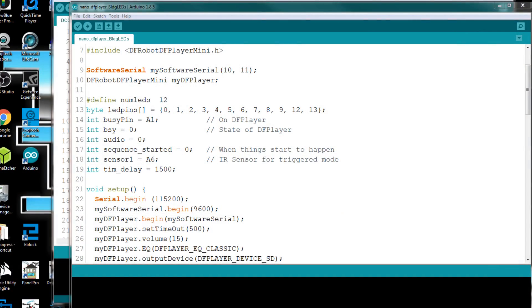These other ones here will start lighting up in sequence - this is clip number one, this is my test on it. Let me show you the sketch that I'm working on. You can see right here I use pins 0 and 1, and those are TX and RX on the nano. The other pins 2, 3, 4, 5, 6, 8, 9 - then 10 and 11 are missing because that's the TX and RX on the DF player mini, and 12 and 13.